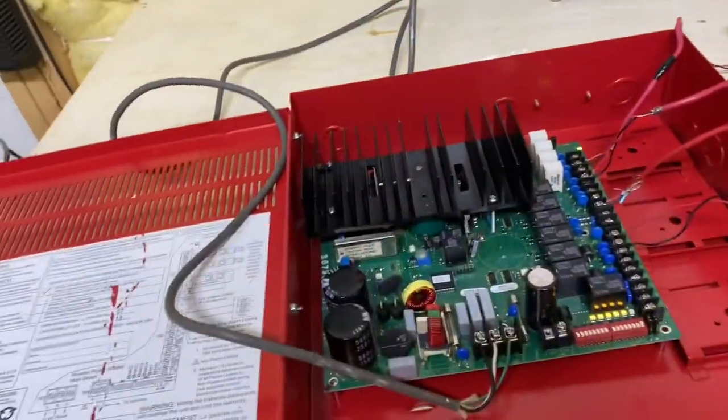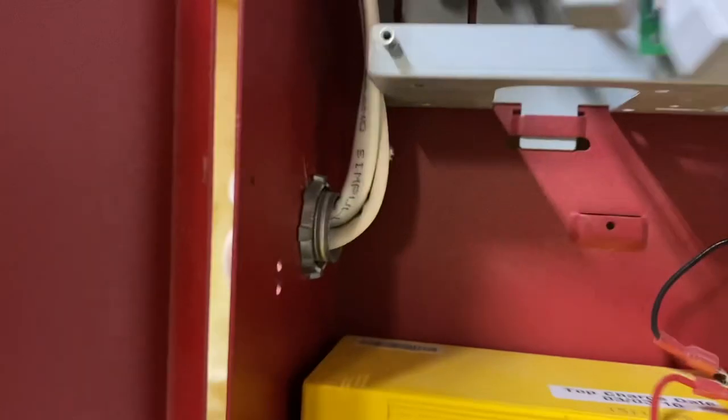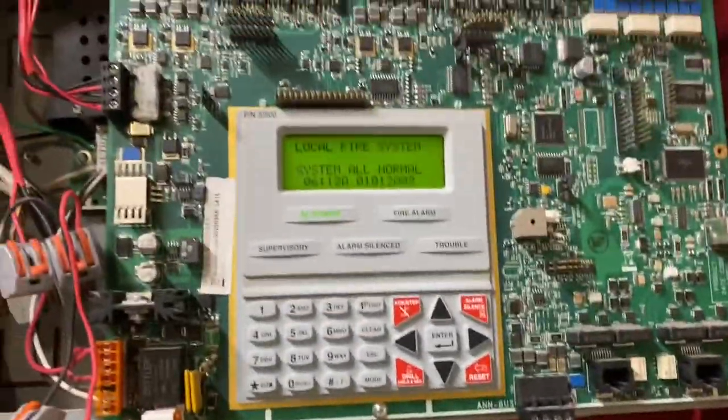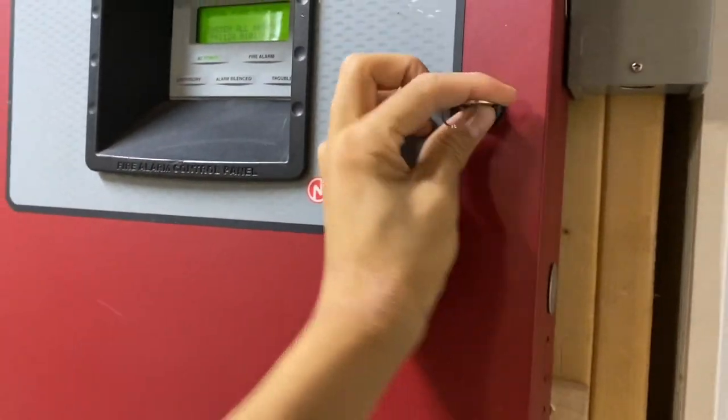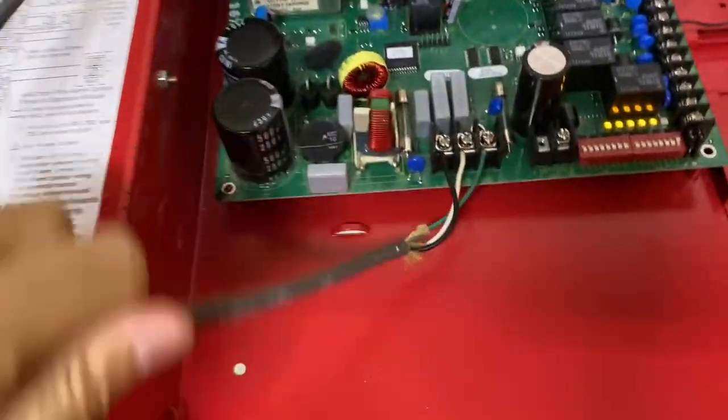You don't have to reset this or anything. It's basically just a triggerable 24-volt power supply. The fire panel has its own power supply right here, and you can see that this is only capable of doing so much — providing power to so many fire alarm devices. So if you overload this thing, it's not going to work right. There are formulas you can use, but since this has its own power supply and transformer wired to the building power, it can provide power for a number of different devices without hampering the effectiveness of your main fire panel.